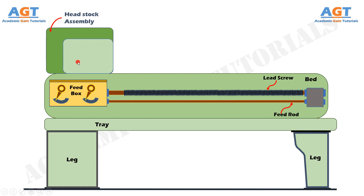There are speed selectors for controlling gear speed. There is also a lever called the driving clutch, which is used to engage and disengage the spindle from the gear mechanism inside the headstock. At the starting of the lathe, this driving clutch keeps the motion disengaged from the spindle, and then when needed, the clutch can be used to engage the spindle with gears for motion, and the spindle starts rotating.